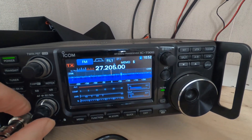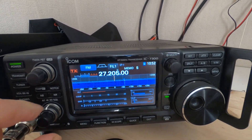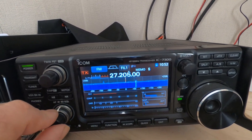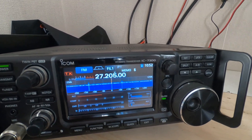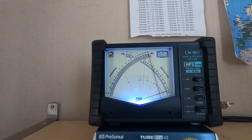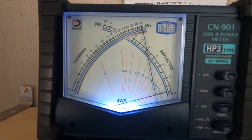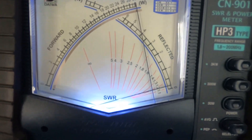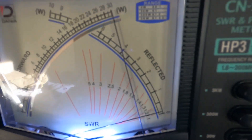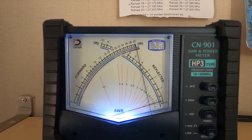Back indoors. There's still nobody on channel 20. So we key the mic — using about nine and a bit amps. Looking at the meter, I can see exactly 30 watts and an SWR of 1.2, which is where the needles are crossing. I think we can all agree on that. Now let's see what happens outside.